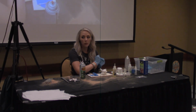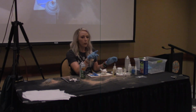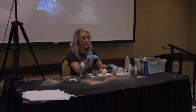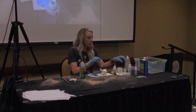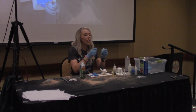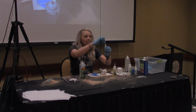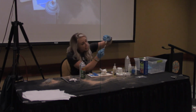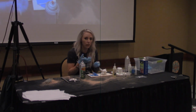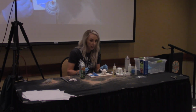Is CA what you recommend to finish your pens? Oh yes, 100%. And let me finish, I just thought about something. If you put some CA on the end, take a Q-tip and put a little bit of CA on the Q-tip. What I do is so that your finished pen, which already has CA on it, doesn't have CA dripping down the side and messing up the CA finish that you just did, so you'd have to redo it. I haven't done that by experience, but it's just something I thought of.